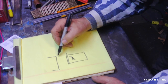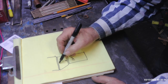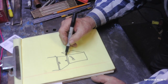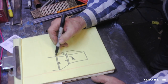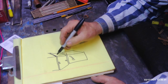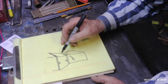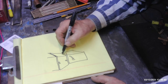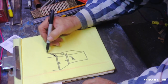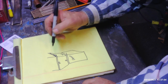So now you draw your plenum in the front dimension you're going to need, and you can put this dimension down here — say that's 16 inches, and this up here is 20 inches. This line is straight, going back to our box — by drawing a box, that's the side of the furnace. You draw this out to where it's the depth of the furnace, and then here is going to be a bigger plenum, so it will flare all the way out. You have the straight line here so you know the true height. If the front is perfectly straight up and down and in alignment, and one side is in alignment, now you've got the true height on that too. Say this is going to be 21 and this is 25. You know the actual heights you can work with, and as long as you measure accurately and mark with your scribe accurately, it's going to come out correct.